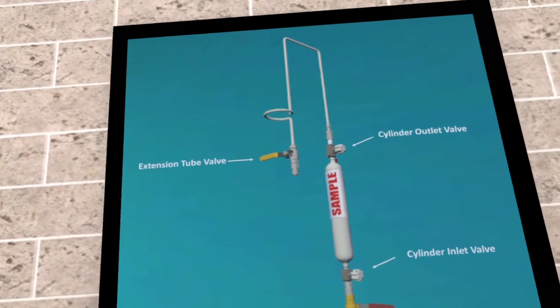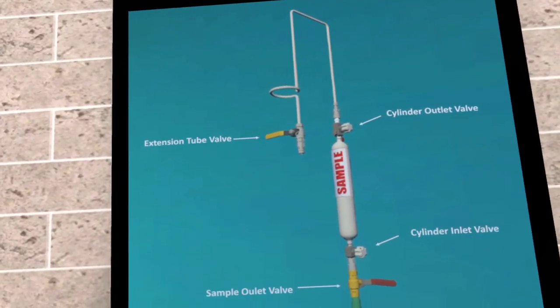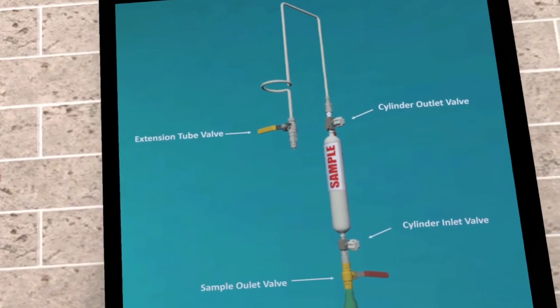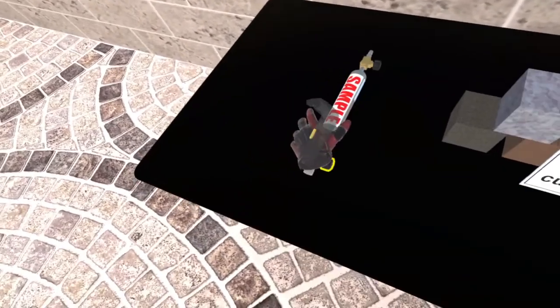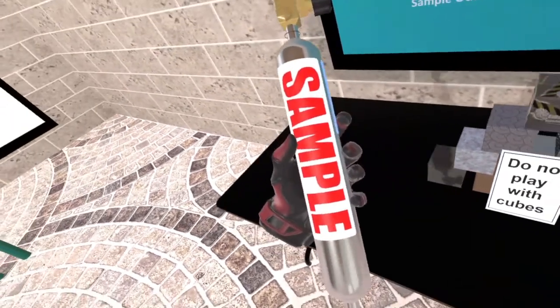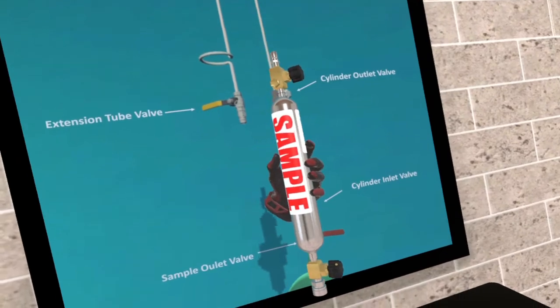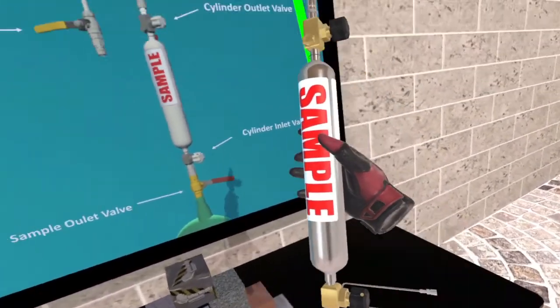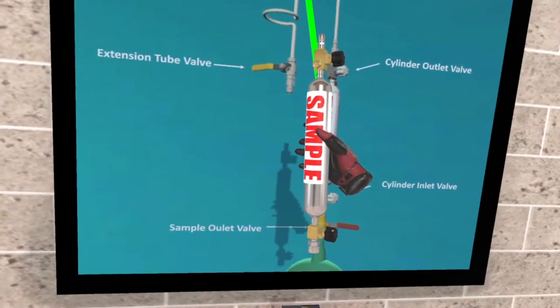Note, if the pigtail is coiled, the user is cautioned to leave enough air gaps to prevent thermal coupling of the coils. Here we have a double valve cylinder, which stores a gas sample in a protected and secure state until the gas composition can be determined.